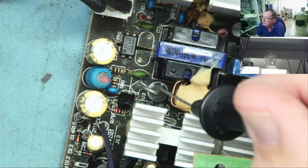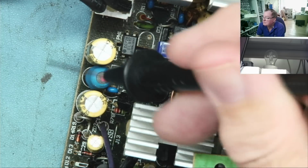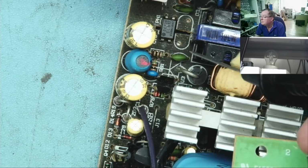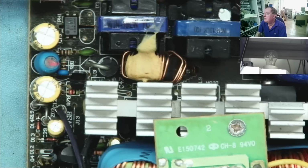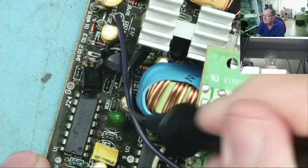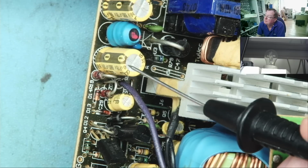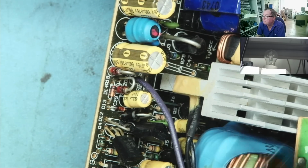So the best place to start is to remove this diode, I would think, and then see which side the short is that we're seeing. But bear in mind that the secondary on here will really affect you like a short anyway. There'll also be a second voltage output from this, and that voltage output will actually be powering these transistors, and probably this chip as well. So it may actually be that one of these capacitors, maybe that one, is on the other voltage output from here.